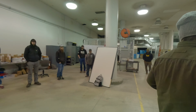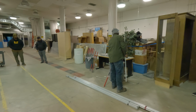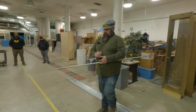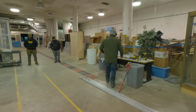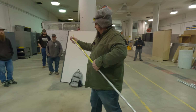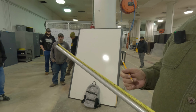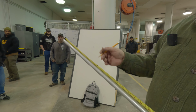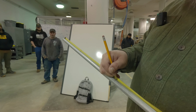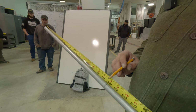But I can try a 3-point saddle. I haven't done one in forever. I never really liked 3-point saddles because they were so easy to mess up. But same concept. Say your start point's 10. Actually, on 3-point saddles, you start at your middle. So we'll start at 20, right? Same multipliers, same everything. So say we want 4 inches.